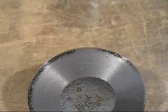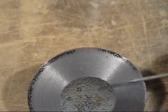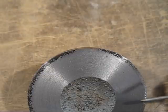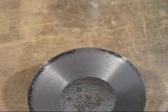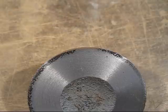Actually, there is another method where you don't have to preheat the mould. So what you can do, that's the in gate, and if you have another gate on the other side where the metal can exit, you can pour it for probably about 5 seconds, so it preheats your mould. Then you have an assistant to shut off your exit gate, and then you'll have casting that won't have any chill on it. But yeah, you can see that that's not a real good idea, but if you haven't got any ferrosilicon, it's probably a way out.